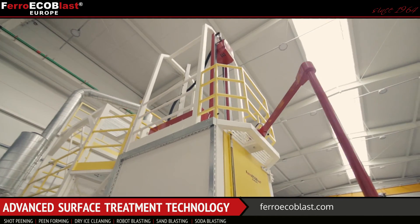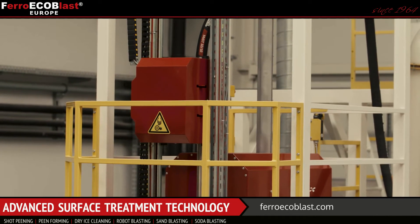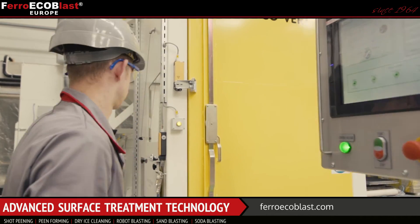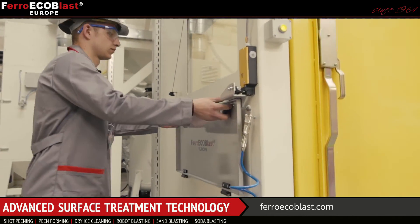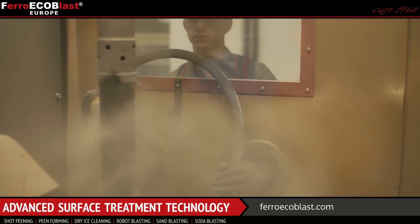The second manipulator has only one blasting nozzle, designed to blast inside, and it's movable in one axis. The machine is also designed for manual blasting, so we have an additional manual blasting gun which is operated with these pedals.